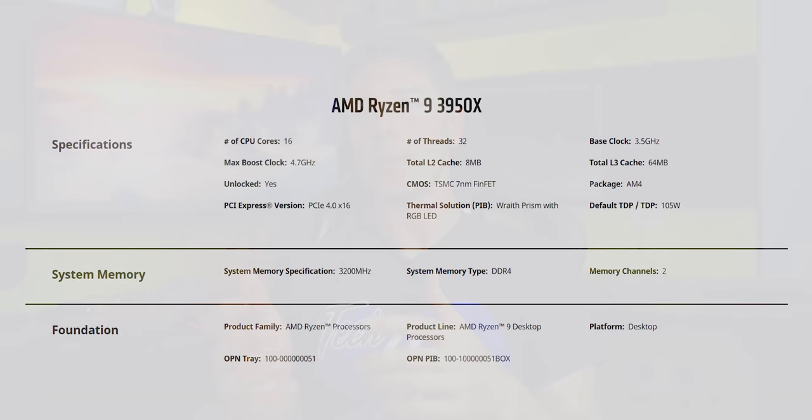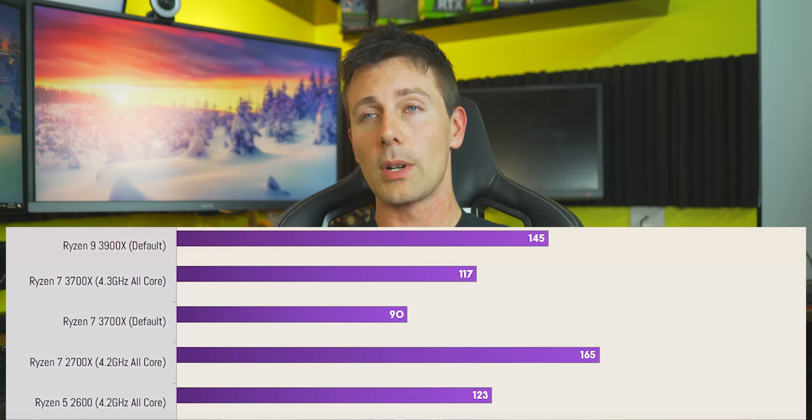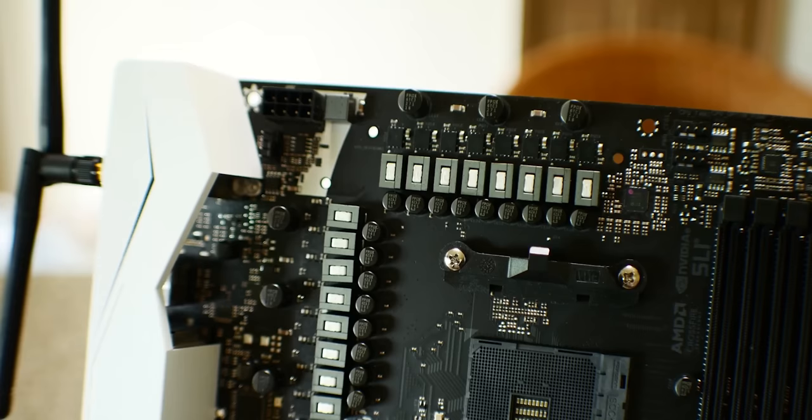And when we got the first gens in, you could draw around, from memory, 140 watts up through the VRMs on those things. And I know the 12 core I've got here, when you overclock that to 4.3 gigahertz, that's drawing about the same power through it. So those X370 boards, especially the high-end ones, were engineered for about 200 watts at least going through those boards. So they're really engineered for high throughput.